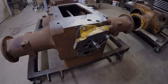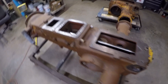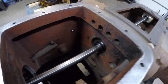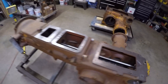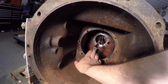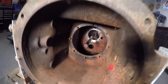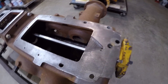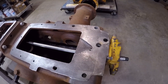I've got the hydraulic pump adapter plate aligned and bolted down, holding the boring bar in position at the back end, and the transmission sliding gear shaft bearing adjustment nut is threaded into its bore with the collar holding the boring bar in alignment at the front end. It's a really nice fit - moves freely, does not bind, yet there is no free play. I've also taken a micrometer and double-checked that the front end of the boring bar is centered within the machined front opening of the transmission housing, which pretty much proves everything is right on the axis it needs to be. All the bores will be in line, and I can start building my brackets and bearings and drive feed mechanism to actually drive the boring bar and start the machining process on this bearing bore in the back end.